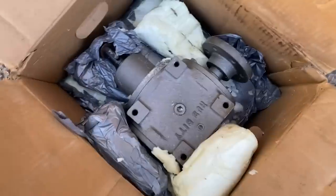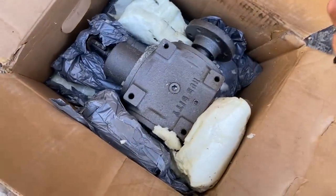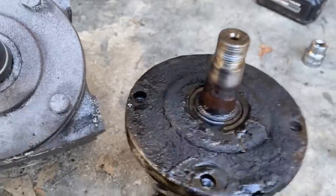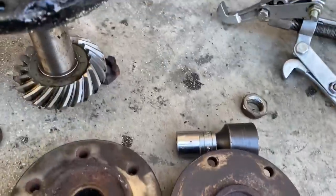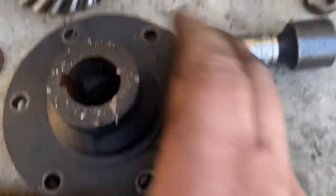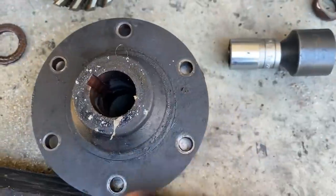Yes. We got our new hub there, our miter gearbox. Awesome, super excited. This came from Brandon at Cardinal Coach. So this is fatter on the new one than the old one. This is the fan drive here on the old one, and this is the new one, so it's a little larger diameter bore. We can use this. The bolt holes almost line up, but they are not quite. They're like a half a hole off, and it gets worse as it goes. But we could clock it 90 degrees, it's the same diameter, and re-drill new holes.